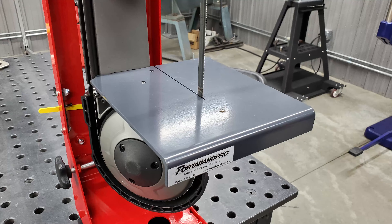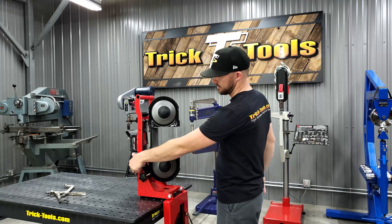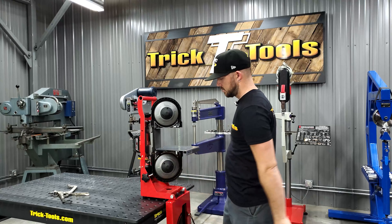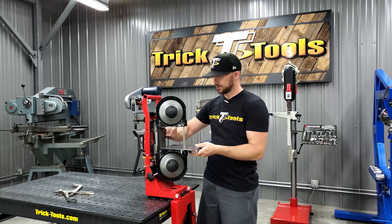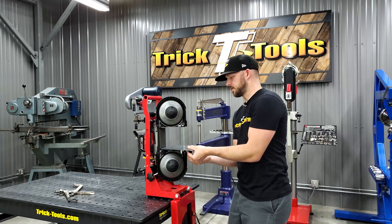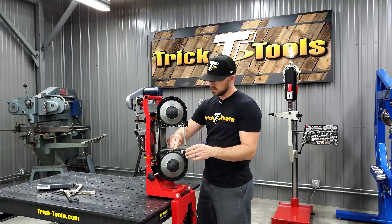Make sure that your blade is not up against the slotted opening in the vertical table — get that tightened up. You can do a quick visual check, or if you want to make sure the blade is truly 90 degrees perpendicular to the vertical table, set an angle finder on there. Once set, fire up the saw and feed your material right in. When done, turn the saw off. To convert back, loosen the set screws, loosen the thumb screw at the front, remove the table, slide it back, lift the base up, and reattach the gas shock.